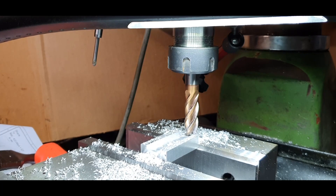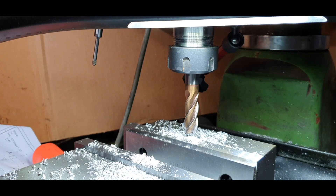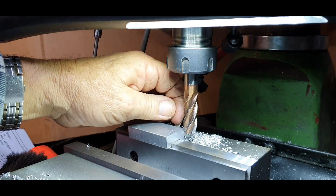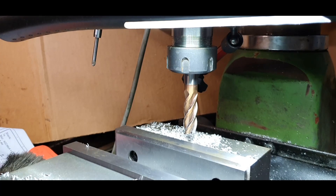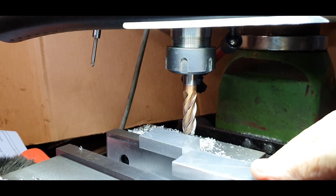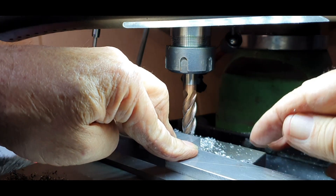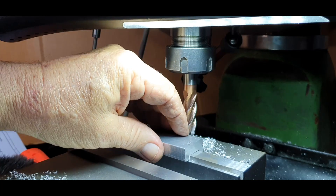That'll be beautiful now. I'll show you what it's supposed to be. I'll probably cut those and make two out of that - it should normally sit on there like so, and then what will happen is it'll have a screw go in from the other side. When you put a part into the vice, for example, I'll get that back onto the parallels, close it up. Once I've faced one side I'll just put it back in, that'll be clamped or bolted down, and that'll go in wherever I want it - an exact match every time. That's one of the clamps. You have to be careful you don't go too deep, otherwise it starts hitting on your parallel and you can have problems.